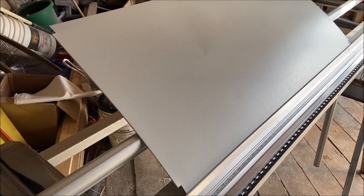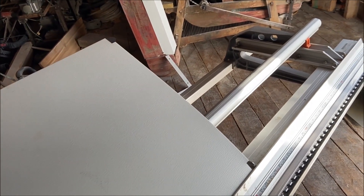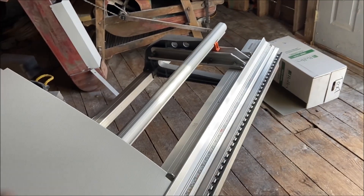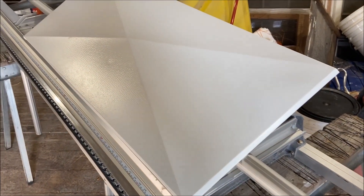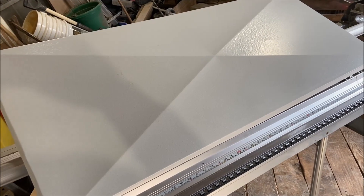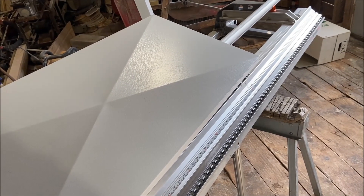It's just a matter of rolling the sides over. One of these ends will be at a 90-degree angle, so when the panel slides on it'll slide until that end hits — that'll be the last thing that touches. The other end I'm going to give a real gentle downward spring bend and allow enough play in those side rails that it can ride over the top. When it gets to the end of the evaporator tray it'll just drop down into place, allowing water to run off the edge and keep it from getting into the pan. There it is — everything bent the way I want it. I just need to cut some pieces of wood with the miter saw and table saw, shape those, attach them on the inside of the sides. They'll basically provide the sliding action so this piece can slide onto the pan and hold it from being able to lift up in the wind.